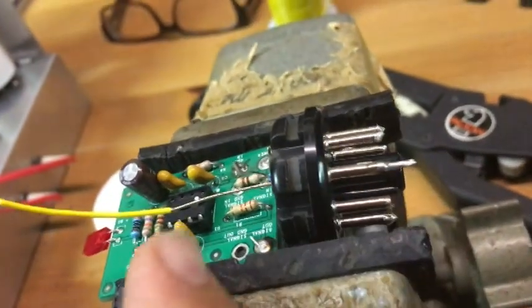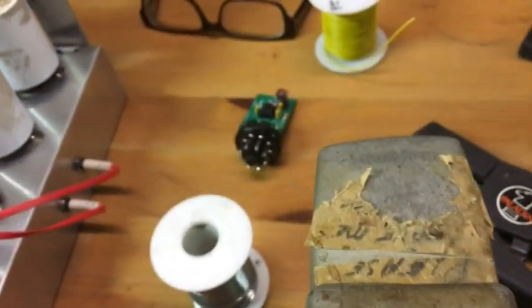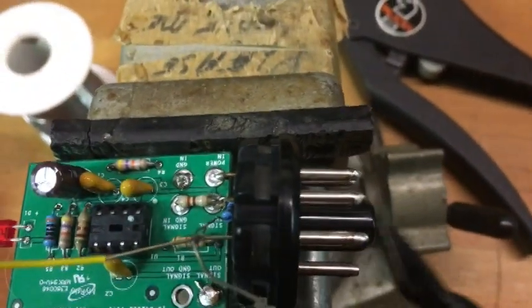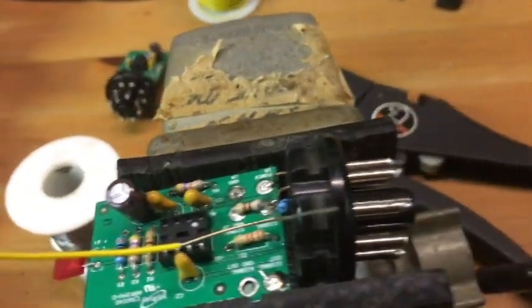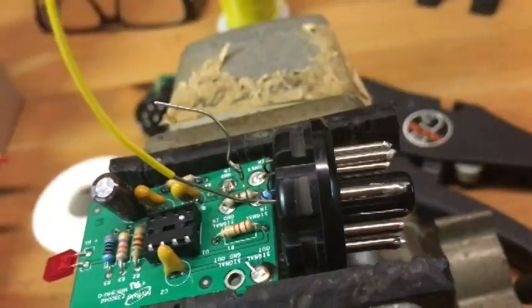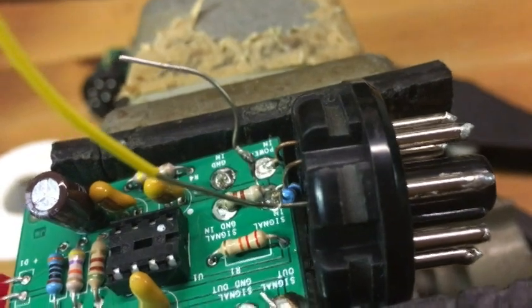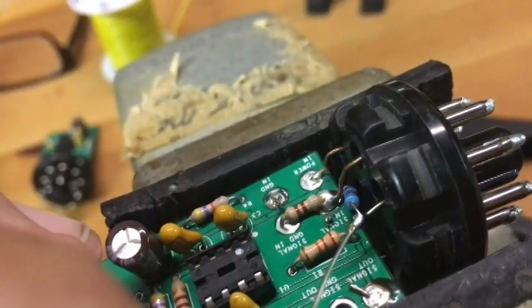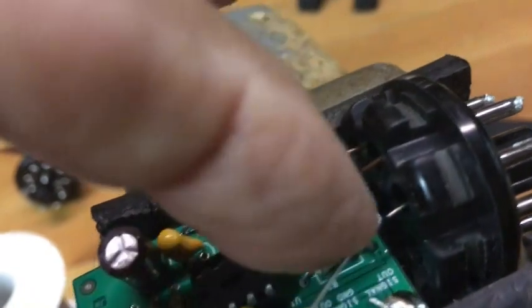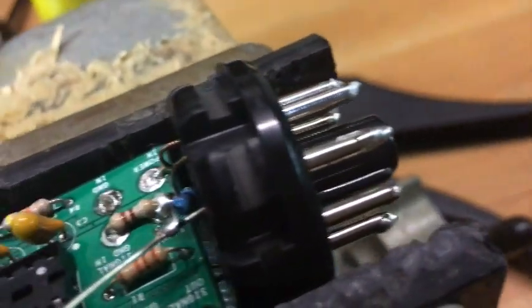So here's this yellow wire, going through and soldered well into the tip with the wire sticking out. I'm going to just clip it right there, and feel it to see if there's anything lumpy around there. Seems to be okay. So I wrapped the resistor wire around the wire that I've stuck into the pin, which is a little heavier. I like a heavier wire going through that - I don't really like that little tiny resistor wire going into that big pin. There's extra solder at the joint and extra solder on the wire going into the pin. Pin soldered, everything should be good.